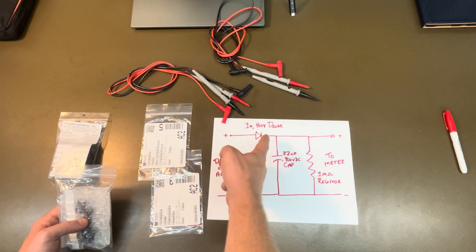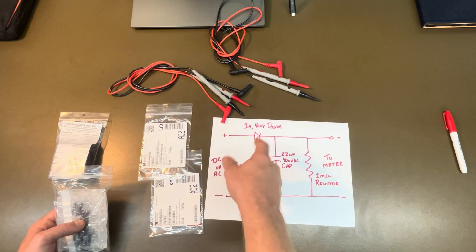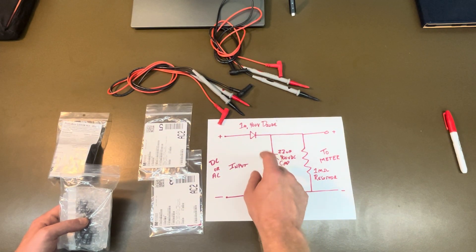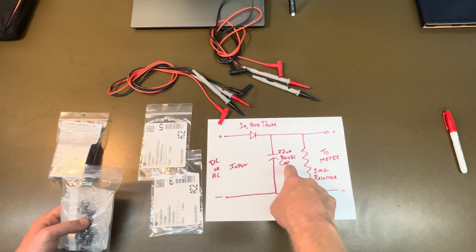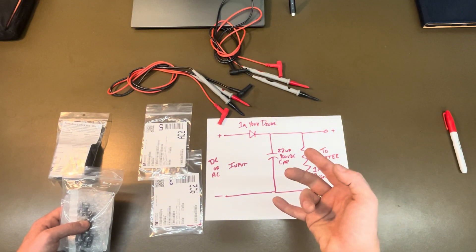Using this device you're converting it to half-wave DC — it's not a full wave rectifier, you're creating a half-wave rectifier. You're taking your peak voltage and converting to DC, using that DC to charge the capacitor. The capacitor only charges to whatever that peak voltage is, so every time it peaks it charges the capacitor. Having the capacitor gives you enough time to actually read it with the meter.